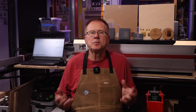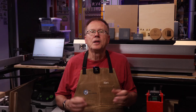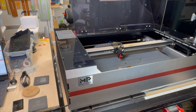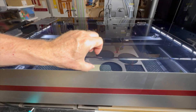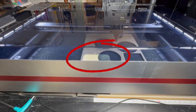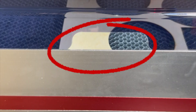The Reno 65W Pro has a maximum speed of 800 millimeters per second and can cut 20mm thick acrylic or 18mm thick plywood in one pass. It has a steel and aluminum frame with a tinted acrylic lid. There is an opening in the acrylic lid that acts as a handle, but this can potentially expose you to the laser, so you should always wear protective laser glasses or goggles.